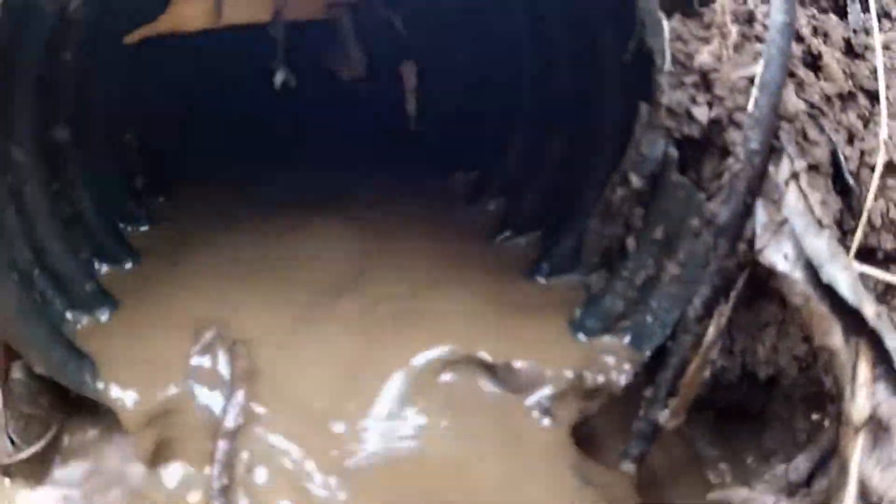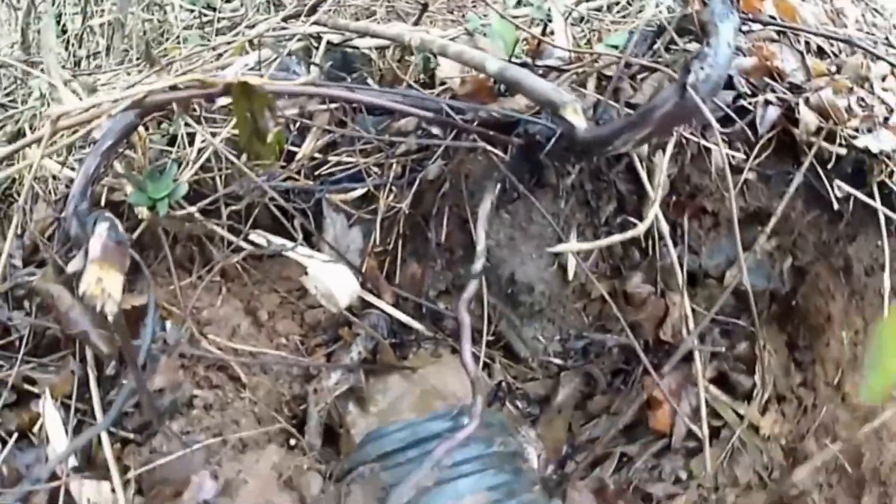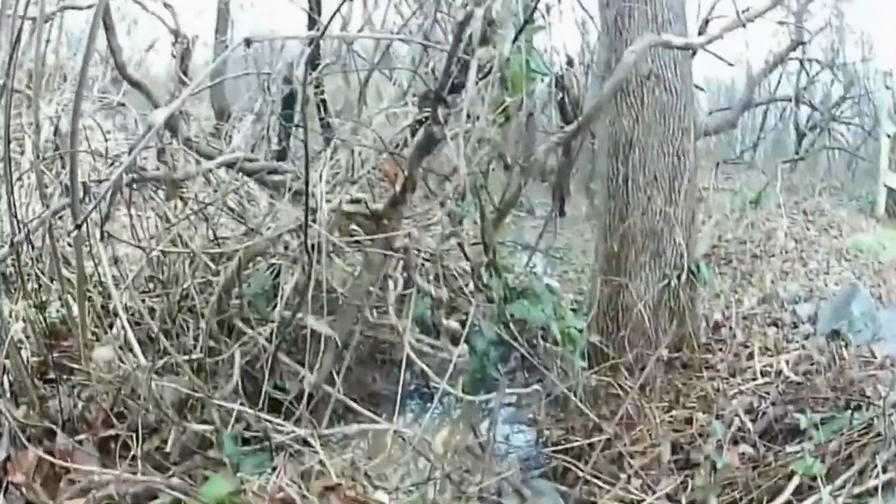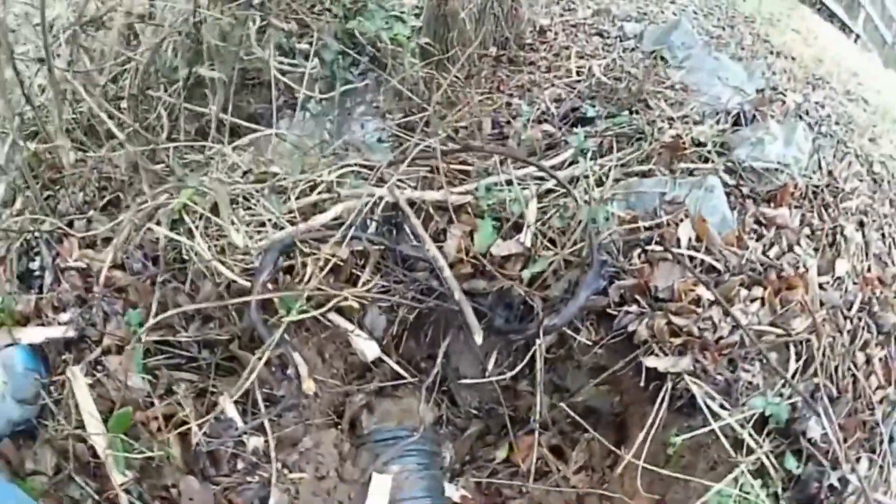Let's walk back here to the ravine, and we can see — look, we've got a great flow of water. Let's look down inside that pipe — tremendous flow of water, see the mud coming out. Remember, water moves debris. The cable cleans out the line, but you need that water to remove that debris.